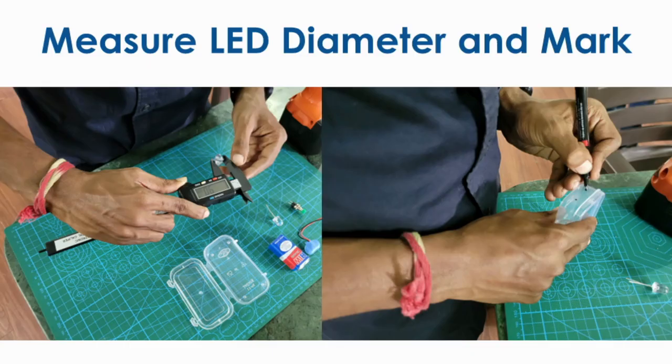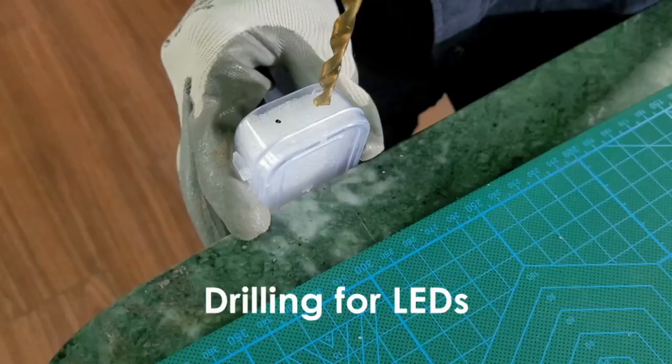So let's first start with measuring the LED diameter and mark it. The LEDs that we are measuring are basically 9 mm. Its diameter is 9 mm. And we accordingly mark on one side of the plastic box. Now we will start drilling